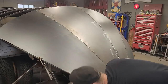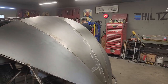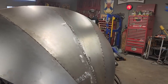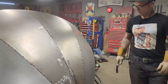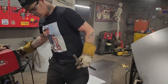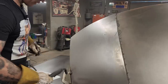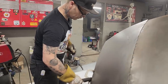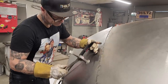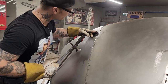Get some spot welds on that. The reason being is we don't want it to take off anywhere, and we want to get that metal nail down so it seems a little more secure. Now I'm going to knock the welder on, and we're going to knock it on every little tap. When you're looking for things to be tight, and you're making something, you want it to be tight. If I come down here and start whacking on this, yeah, you'll get it somewhat close. But basically the best way to do it is to tack it.